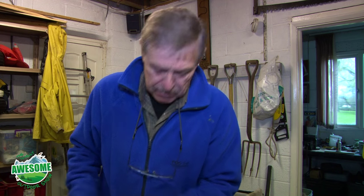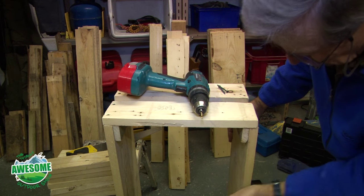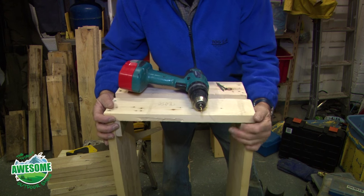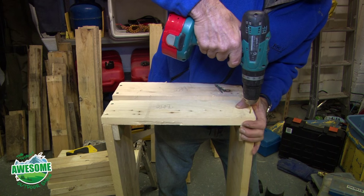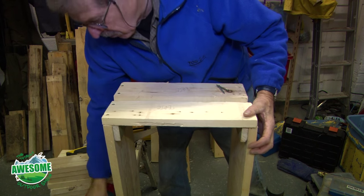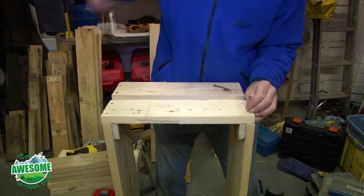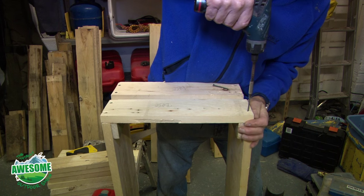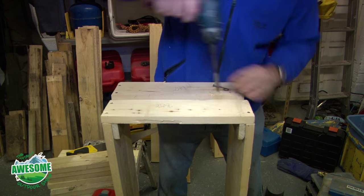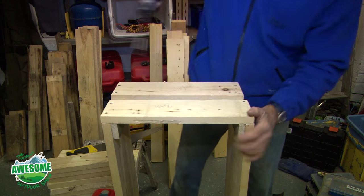Now what we're going to do — I've got everything fitted together: sides, bases, tops, and guttering bottom supports. I think I'm going to start building the mainframe. I've got my two sides, which are held together by these supports here with screws that don't come through the other side. I'm putting the base on here, but I'm pre-drilling the holes because being near the edge of the wood it helps stop them splitting — you only go through the top piece. It basically just stops the wood splitting when you're near the edge. Then just send the screws in and line it all up. Set your torque control however you want for soft wood. That's the base done.